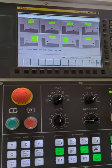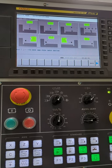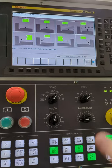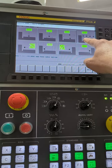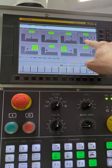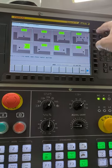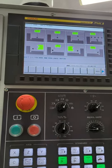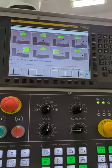And so on that part, the first thing I did was this multi-plunge. Okay, so based on the wheel, I have 2 plunges, and then it grinds the fine and the polish and the traverse. So it plunges, gets rid of most of the material, and then it blends it together and does a really nice job. That's a good one that is used often.